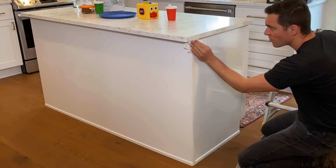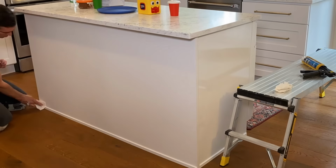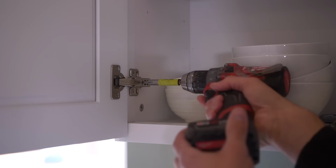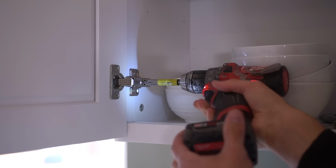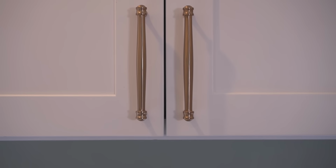After I go through the entire kitchen and take care of all the seam work, it's now time to adjust a few of our cabinet doors that are not aligned properly. A few of the doors have a larger gap than I want, so I adjust the center screw on the hinge that's closest to the door, which repositions the swing and therefore gets the doors closer together.